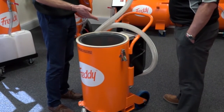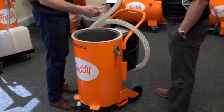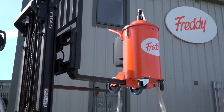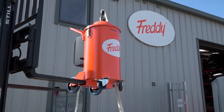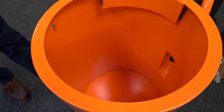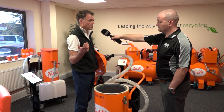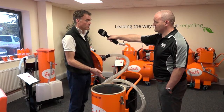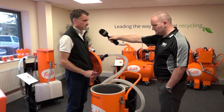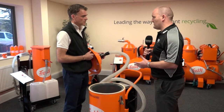The customer can clean the liquid using the filter steps to an acceptable level so it can be returned to the CNC. On this model it's gravity-fed — you just turn a ball valve and let the liquid run out. You might wonder how that's possible on something so low to the ground, but the customer can use the forklift channel at the front to lift it, secure it, and run the liquid into the CNC or into a barrel for waste. You don't have to have a large product to do your recycling.